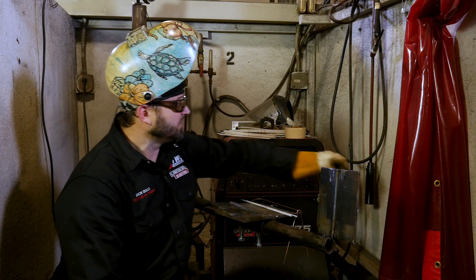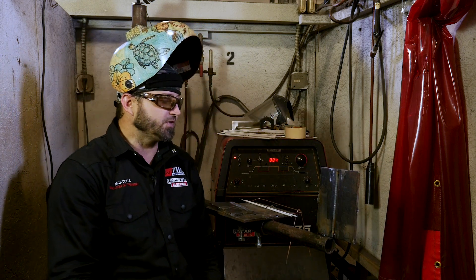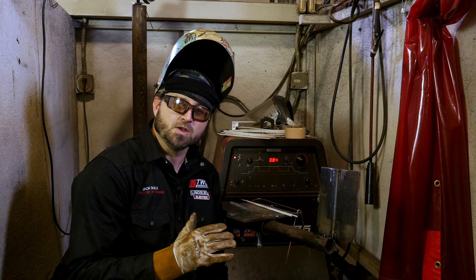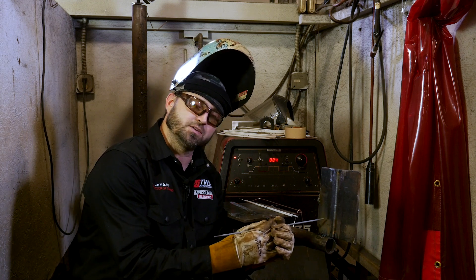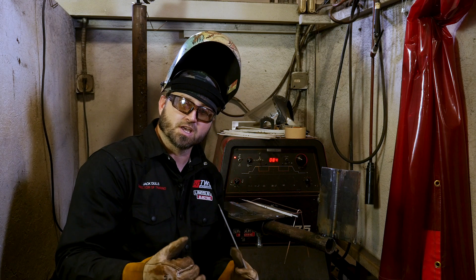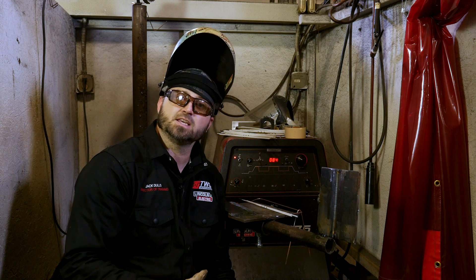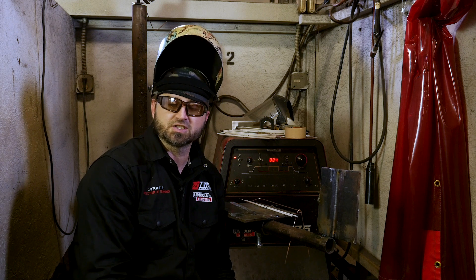I'm going to run a 6010 root at around 84 amperage or so. And it's all about the keyhole — keeping a nice tight arc length in there. If you're starting to long arc, meaning getting the rod farther away from the metal, what's going to happen is it's going to create a bigger hole. When you get a bigger hole, you cause yourself more problems, having to move more and try different things. So it's all about prevention — let's prevent it from getting to be a big keyhole. I can show you tips and tricks on that another time, but right now we're focused on running this project out.